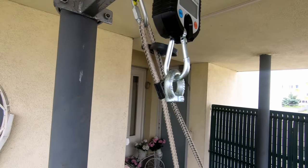So no wonder it doesn't break on my test, because I had a maximum of 140 kilograms. Okay, let's see the M6, same calculation, but of course with a different area, and I can calculate that it is 119 kilograms, so theoretically this should break on my test. I printed M6 and I will do the test only to compare vertical and horizontal position in this pull test. So let's see this.